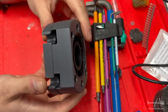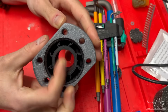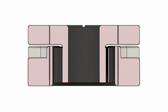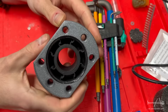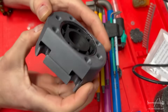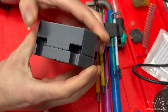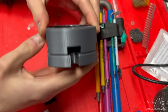So here, I've printed the 200% scale model to feel and understand this concept. The 2 silver parts represent the 2 machine aluminum parts. As we can see in the cross section view, they are not fixed together — only the middle insert part is fixed to them. I printed the insert in TPE so it's more flexible for the print model. For the real parts, we printed them in PA12 nylon, but we might try and investigate other materials in the future.